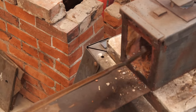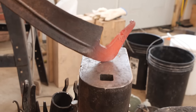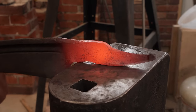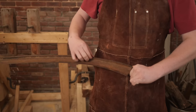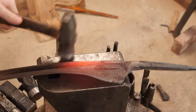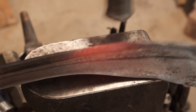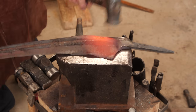The steps to transform the scythe blade into a sword begin with straightening out the tang, which is where our handle will be connected. Then the thick part at the back, which acts as a spine for cutting grasses, will be flattened and drawn out into another edge. Doing that will help straighten out the tip and give it a second cutting edge so that it can be used from both sides.